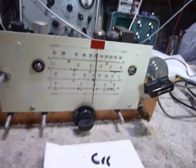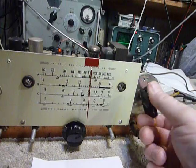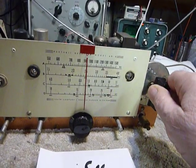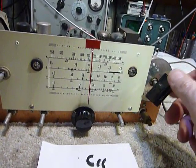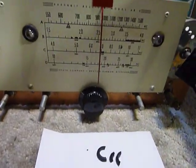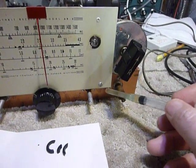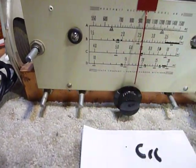I just took it out of the case. I've installed these big old knobs that have a lot of grip — you can grab hold of them and turn them much easier than little knobs. The reason is that the controls are so stiff and the lubrication so thick that they're difficult to turn. Using my syringe, I've put a tiny bit of oil on the shafts — on each one, on the band switch, each one of these controls.